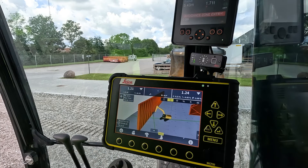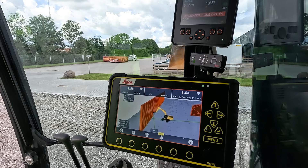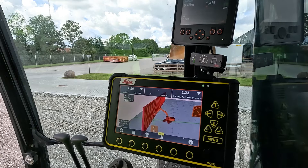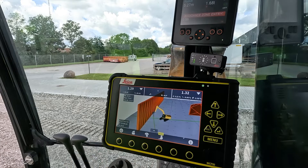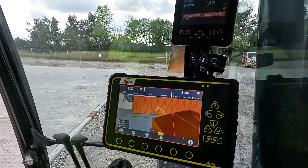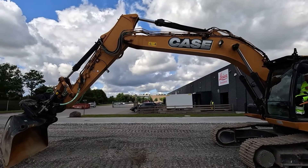This means as I pull in, I will increase my power as I'm moving in. As soon as I move out, the hydraulic power will ramp down again. Once I reach the avoidance limit, the alarm will be triggered. Just to demonstrate: as soon as I've moved away, you can see how the model changes color, and of course the further I get away from the model, the more my power will increase on a proportional basis. And that's the very basics of how the avoidance system works in principle.